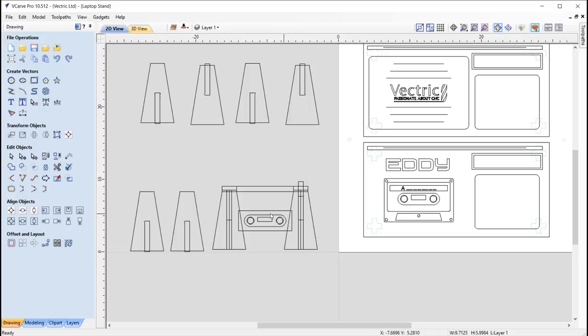And we've got a little bit of a design here, so again we're just echoing that cassette from the cassette that we've got here, and we want to insert an acrylic piece for this kind of oblong shape. So we'd take this vector and this vector here and copy them over into a new session where we could look at creating the toolpaths for the acrylic side of things, as that's what we're going to machine first.